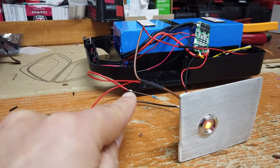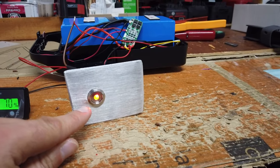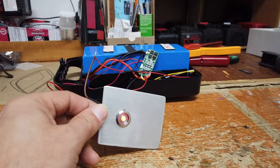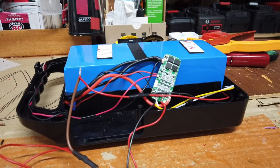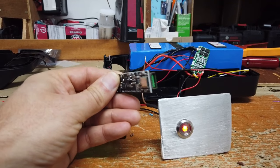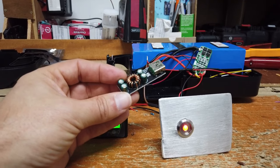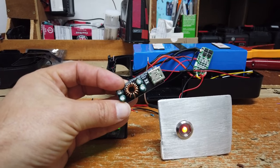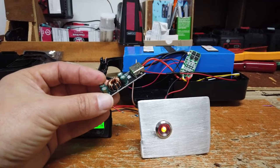In order to get the LED working in the switch, I managed to find upstairs a 1k resistor, which gets that 12 volts down to a couple of volts for the LED — and that's about perfect. These are the USB-C devices that I plan to put in there — USB-A and USB-C — and they offer 65 watts to 100 watts of USB-C at full power. Really quite impressive little devices: super fast chargers for phones, laptops, tablets, all that kind of stuff.